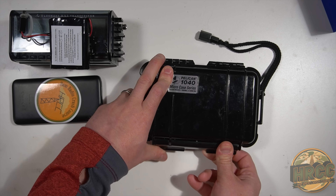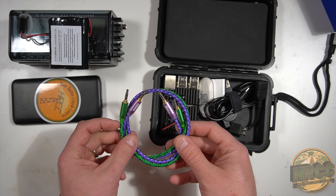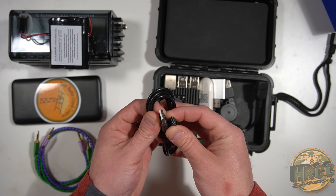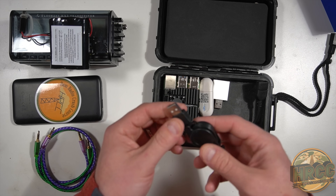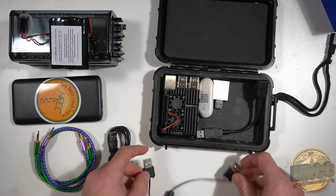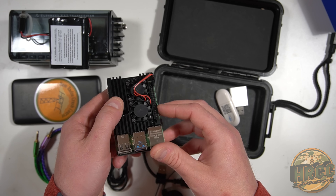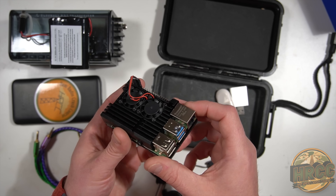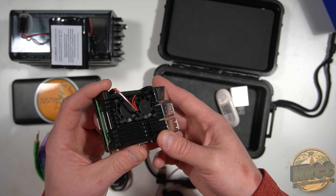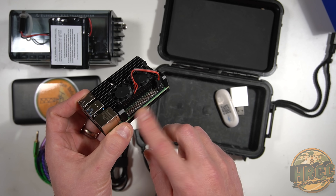In this little Pelican box, this is pretty much all you need to get everything running. Two audio cables — the mic and speaker cables that go into your Raspberry Pi. A USB-C cable to power the Raspberry Pi 4. I've also got a couple of USB-A to A extenders. The Raspberry Pi 4 lives in this aluminum case — I'll post the link in the description. By the way, this case has fans. Raspberry Pi 4s can get kind of hot, so it's nice to have cooling, especially if you're doing a SOTA activation or out somewhere with a lot of sun. The aluminum build still gives you access to the GPIO ports, which is good.